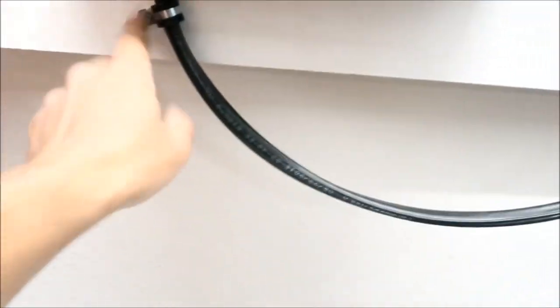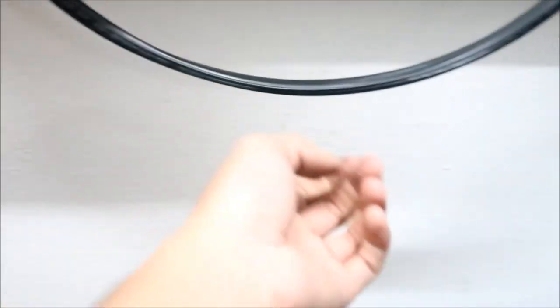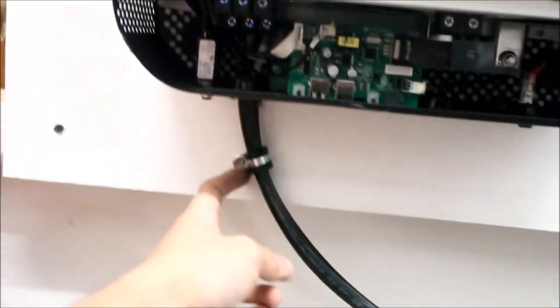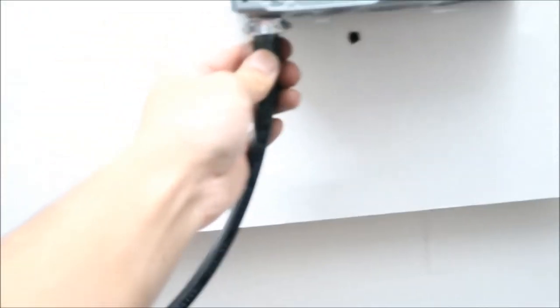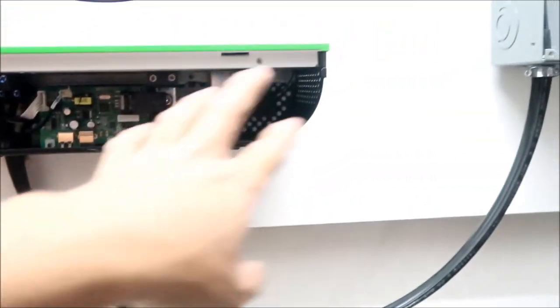Okay, there's my handiwork. I used one of these Harbor Freight insulated clamps — glad to finally use the big ones. That will keep us from pulling that wire out of the inverter. If I accidentally pull on this, it won't come out so easily — you'd have to rip it right out of the wall. There's also a clamp protecting the other wire. I might want to check continuity between the two wires too, to make sure they're not accidentally shorted inside.